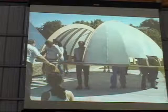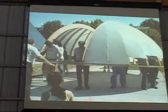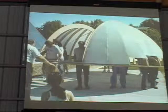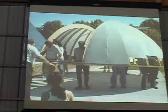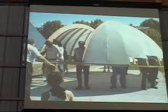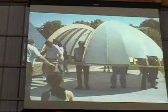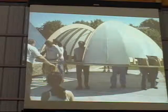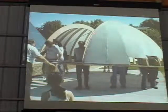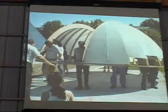Getting the dome out — it's not that heavy, the fiberglass is light. Now look at the connections — all these screws. You need them to hold it down, but you also need it to be waterproof. It turns out fiberglass panels with latex caulk — even silicone caulk — it lasts forever and almost gives you a permanent bond. Even if you take the screws out, you can't rip it apart. Just make sure you seal all along the edges, because that's where you're going to get leaks. If you put a bead of sealant before you put the screws in, you won't have any leaks.